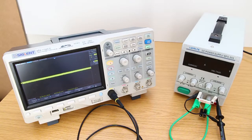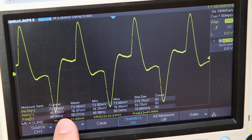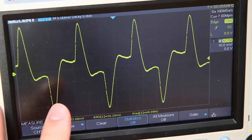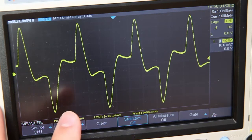First, let's get a baseline measurement for the ripple in original condition. Right now we are at 16.5 mV RMS value and a peak-to-peak value of roughly 73 mV. Let's take that as our base values.